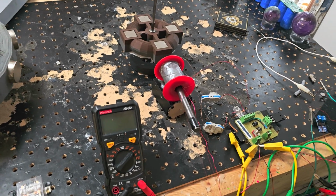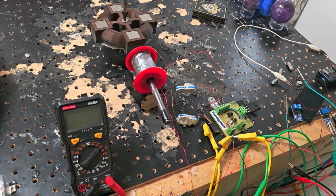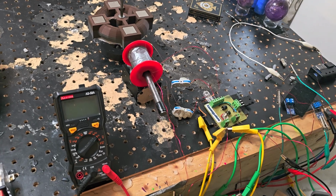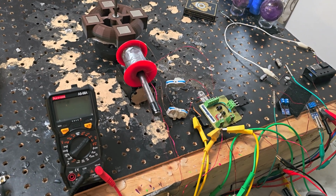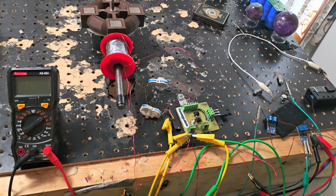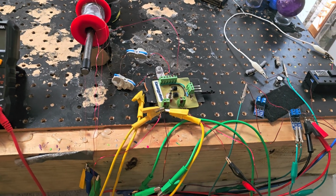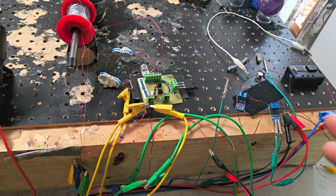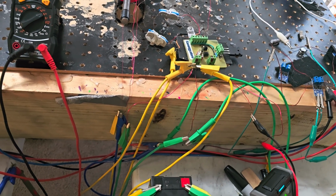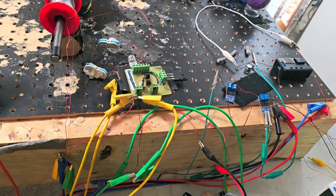Alright, what we're looking at here is a coil. It's a tri-filer coil. It's got 777 turns of 24, 32, and another 32. So our tri-filer strand, as I like to call it, is being hooked to the output of my SSG circuit. Right on the end, it gets sent out with the rest of the output. It nearly doubles the output.